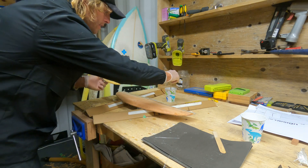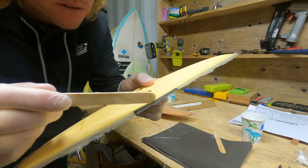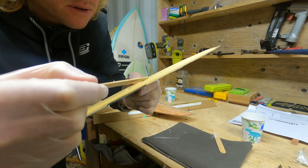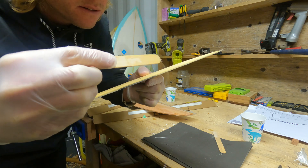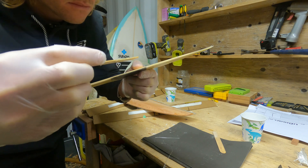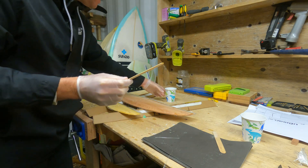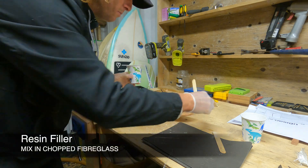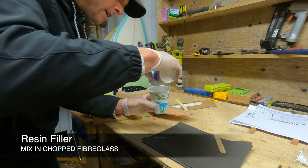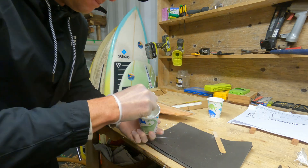There are a couple of very small imperfections — you can see this tiny little hole right there. I'll just dab some resin in there so we don't end up with an air bubble later, and there's a second one here too that I'll work some into. Now that the trailing edge is done with the fiberglass powder, I'll mix in the chopped fiberglass I prepared. That will add even more structure to the mix.